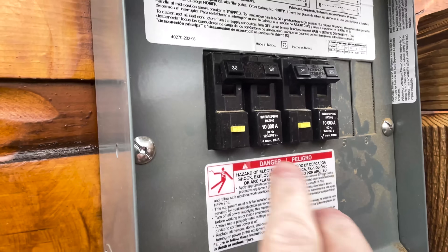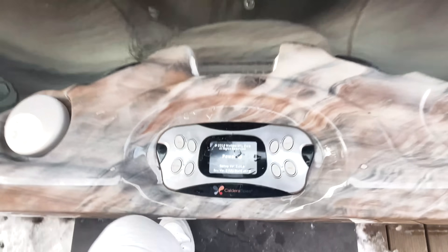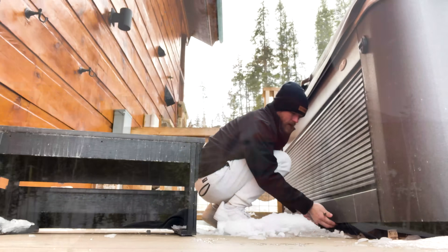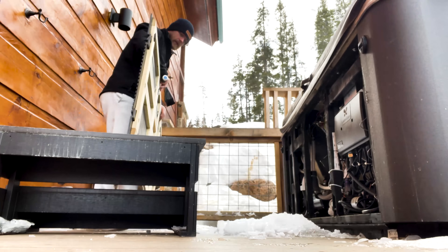I'm going to trip it anyway — still got our GFCI protection, so we're good. They said they just got a brand new hot tub. So what I'm thinking is they probably have a hot tub that's sized larger than the conductors and the overcurrent devices, the breakers. Sure enough, I went and reset the breakers. Everything was fine as long as we just kept it on low, we had no issues. But any time you got both of them on together — both of those pump motors — it would trip the breaker. So I figured I would just open that and show it to you, talk a little bit about the code and sizing breakers and everything for these motors.